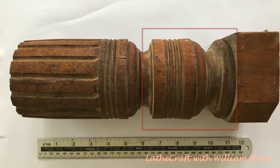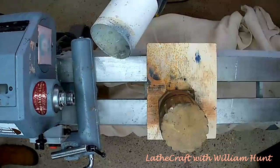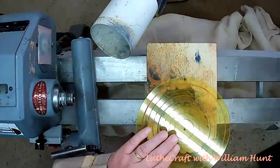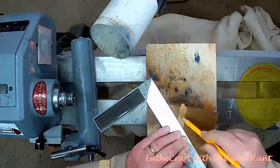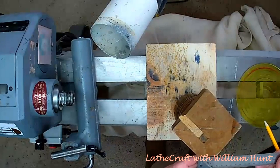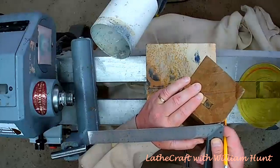Finally, I see a box utilising the bottom section as the bottom of the box and the piece above it turned upside down to make the lid. I don't think the final product will be very pretty, but it will be an interesting technical challenge. So the first task then is to find the centres of either end and get it mounted on the lathe. I'm not too worried about 100% accuracy at this stage because I'm going to have to remount it after I've cut it into three sections.